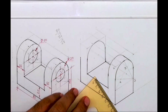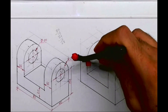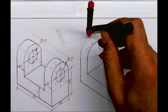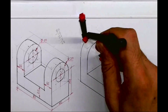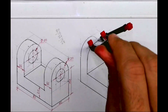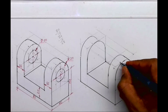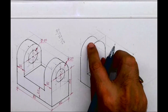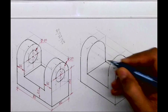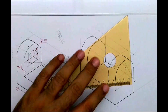We can draw one more circle, and from here we can draw a line. Again take this radius, draw the arc, and draw the tangent. See this — same way you go behind by 16 and draw the arc. All these points are important. If you don't want to project it like this, then you have to draw the rhombus again and draw a circle.